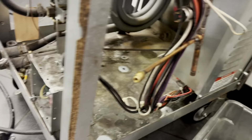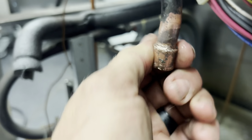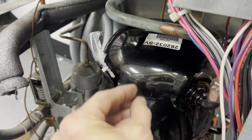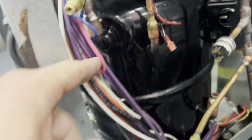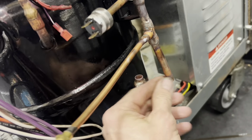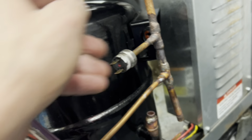No sense doing any sweating in there that you don't have to. Out here we put the fitting in that's going to take the discharge line. The suction line still has its fitting, so we're going to clean that up. I've transferred over the port. We welded it over here away from the wires, then pivoted it into place. We've moved the wires back to the other side and we're going to rewrap everything and clean these really good.